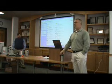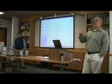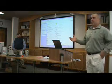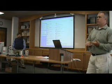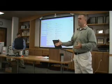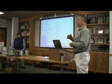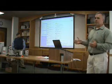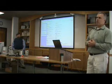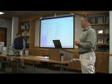And the service providers in the room, things to keep in mind is as you begin to inspect systems that are mounds or so forth, they're a little more complicated. They do have time dosing, and you do have to check distal head pressures and make sure that the whole thing's working properly. Probably not too many of you have seen them yet because these new houses aren't selling yet, but they will, and you will probably begin to see them. And you might want to get educated or defer to somebody who understands these types of things. Probably most of the installers in this room at least have done some kind of a mound or something with some of the more complicated controls on it. So we appreciate them enlightening us a little there.